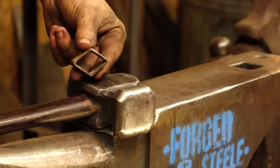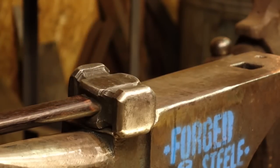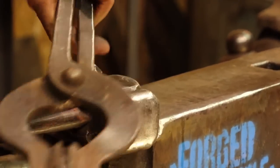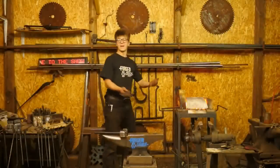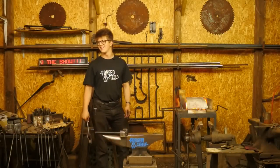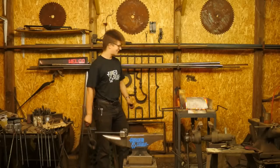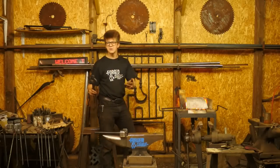You get a tong clip this way and that way, and a tong clip this way and that way. What you can also do is put it on your tongs that way and then tilt it over and really get a nice tight grip. And I'm gonna go ahead and use this. It's nice, it's light, and the best thing is it's super easy to make. How long did that take you to make, Roland? 3 minutes. So that's great, that's what you want in a tong clip.